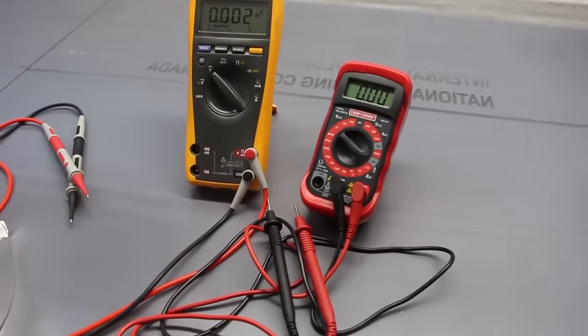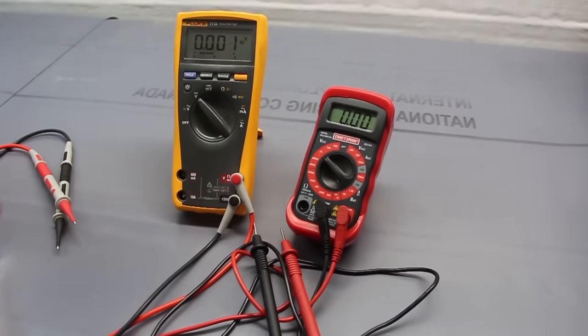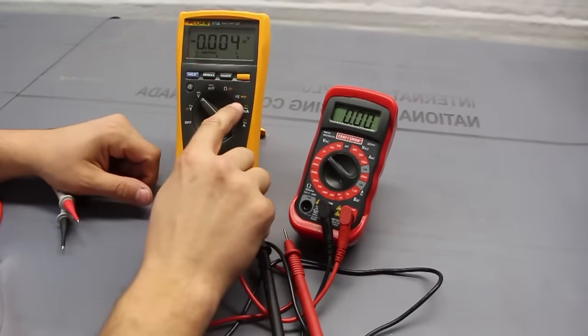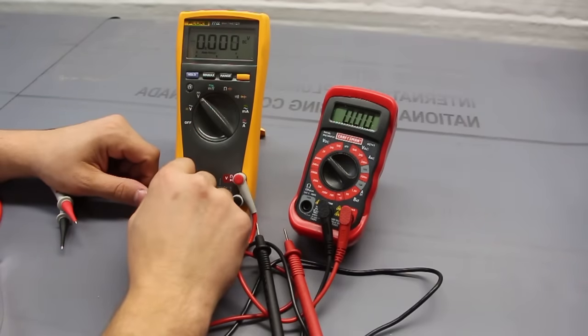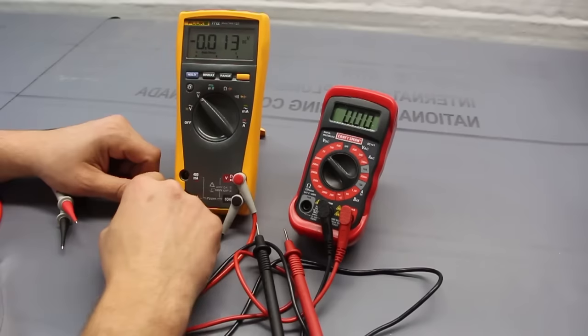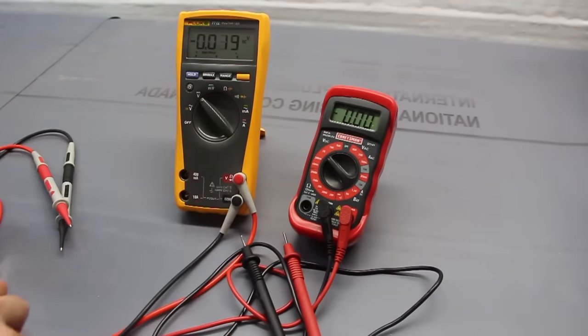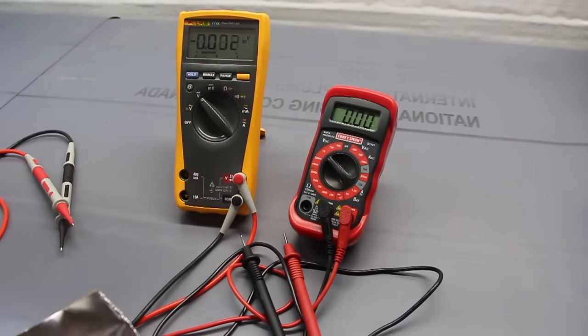Measure conductance. I wanna see if something is conductive. And you can do that a couple ways. Some of the readings actually make a tone. Other ones, you can just use the ohm. So I'm gonna keep everything where I'm at since I'm measuring ohm. And what I'm gonna measure conductance of is a piece of tape. And I know that sounds kinda odd, but this is metallic tape.